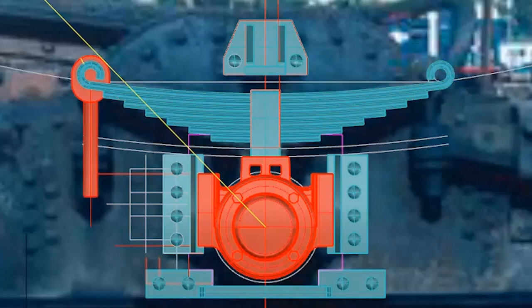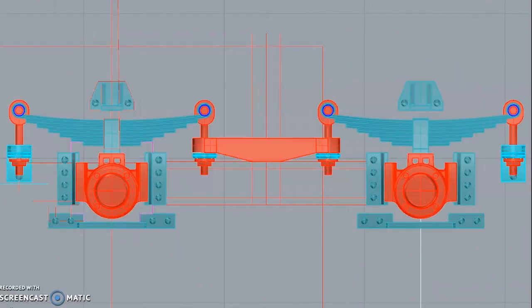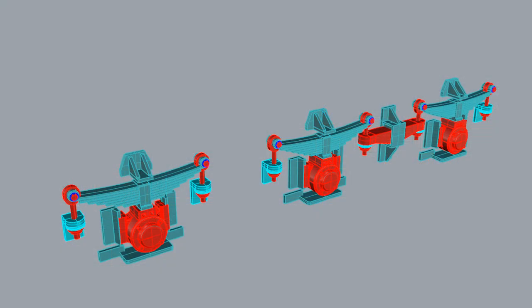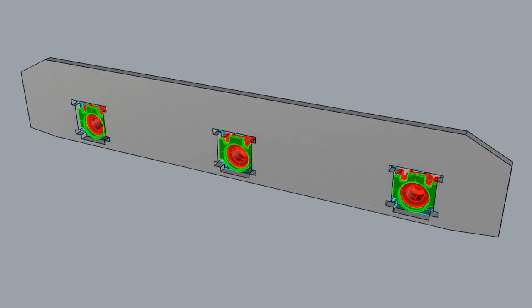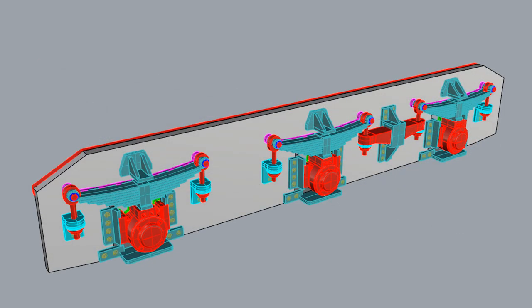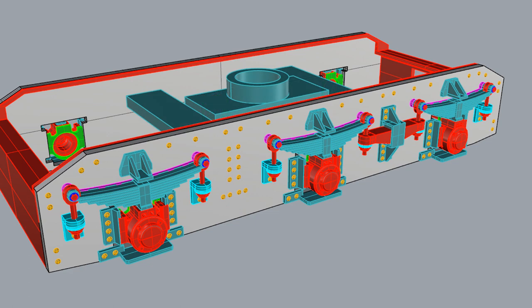I then added the suspension hangers, bolts, fixings and brackets, and also produced a balancing spring between the front two axles. I had to add some thickening pieces and small components to tie the springs back to the bogey sides. After that, it was a relatively straightforward job of tracing the outline of the bogey, reproducing rivet heads, and then mirroring it all onto the second side of the bogey and joining the two together and putting a bit of extra structure in until we got the finished item.